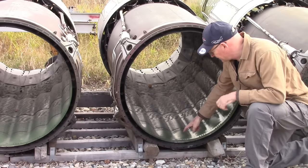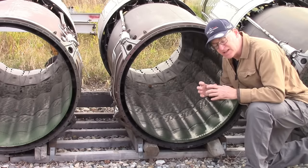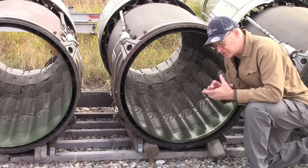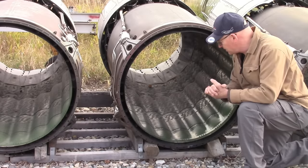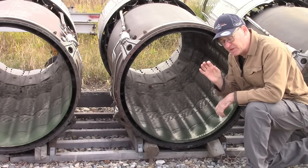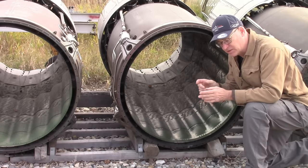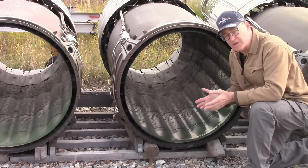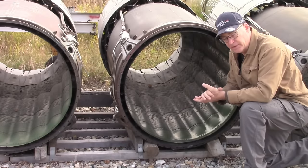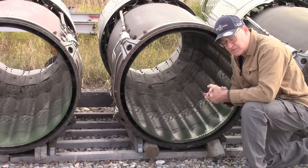This is an easily manufactured way of making it like an accordion, so that if the liner expands a huge amount due to heat — or even a small amount — it's not going to buckle in its mounts; it's going to accordionally absorb the extra expansion. Also, just like corrugated cardboard: if you stuck the three pieces of paper together flat they wouldn't have as much bending strength. The corrugation makes it, in the lengthwise direction, quite a bit more resistant to bending, wobbling, and warping. That's what I think — if you have other ideas, feel free to put them in the comments.